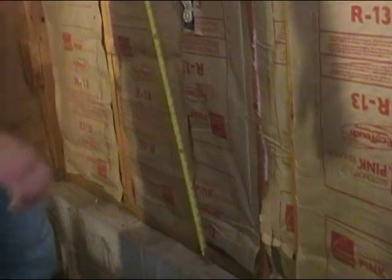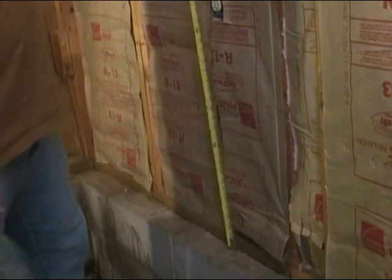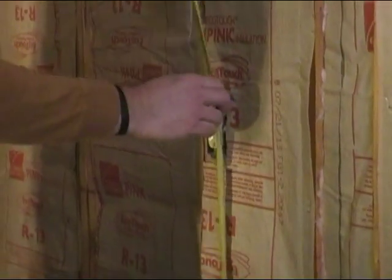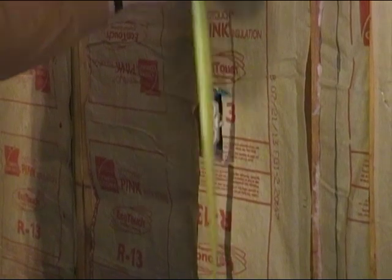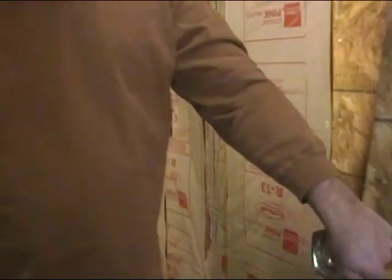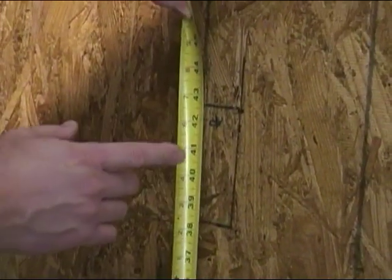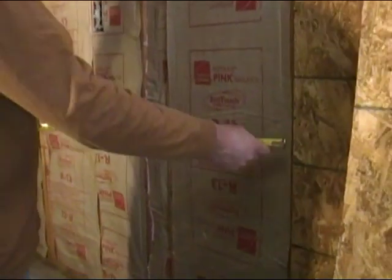The first thing we did — since our plywood doesn't go up against the brick, it's up off of there approximately an inch or so — I just took a rough estimate to the center of the box. That looks like about 27, and that looks like about 41 and a half. Then we came over to our board and in that general area, just kind of eyeballed the distance, and put a little scribble mark at 27 and 41 and a half, just to get a general idea where to mark on the board.